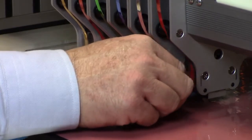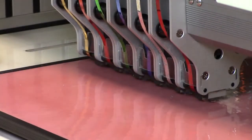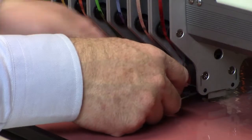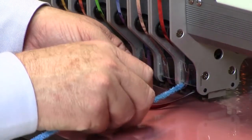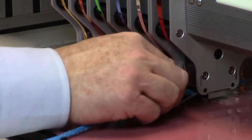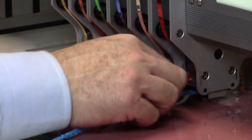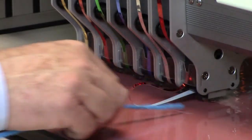You'll notice I'm running this from front to back all the way through, and I'm doing it underneath the spangle tape. Now I want to take a little screwdriver to pull a little of that tape out, then get on top of the tape to clean the top part of the punch. This is going to remove any little fragments of spangle tape that might be broken off in there and any excess oil from the punch area.